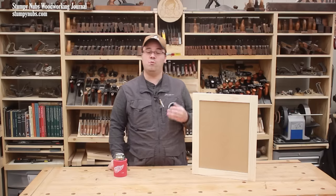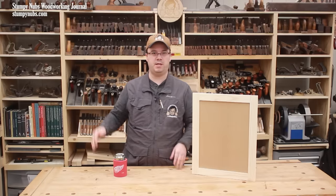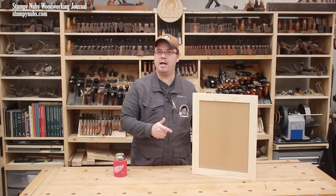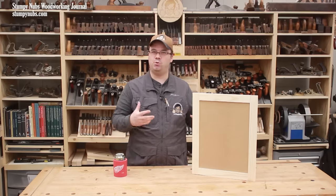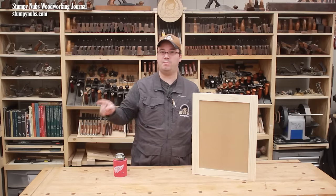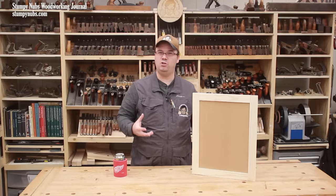Let's begin with your choice of wood. If you're watching this video I assume you don't have a jointer or a planer, so you'll be using boards that you buy off the shelf from a home center. I'll be using pine in this video because this is just a demonstration. I wouldn't use pine for a door that I wanted to last, especially not the stuff you get at the home center — it's poorly dried, it's likely to warp over time, and it is not durable at all. Poplar is a better choice because home center poplar boards are usually of a higher grade, so they're more carefully dried.